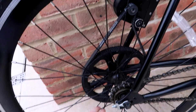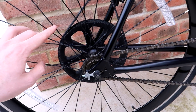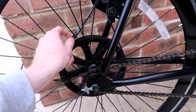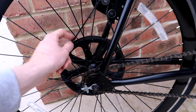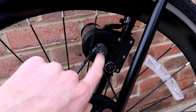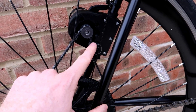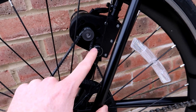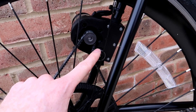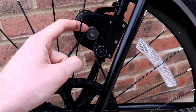I printed the large pulley in four pieces because my printer bed wasn't large enough to do it in one go. From there, an 800mm long timing belt runs to it — 15mm wide for extra strength so it doesn't snap. The belt wraps around a 14-tooth pulley attached to the motor. I also have what I wouldn't really call a tensioner, but it keeps the belt at the correct angle using two skateboard bearings, to engage as many teeth on the motor pulley as possible so it doesn't slip.